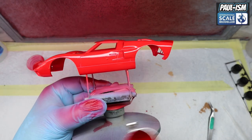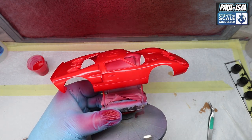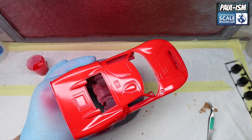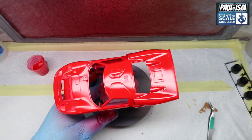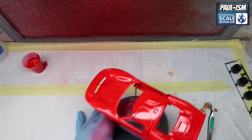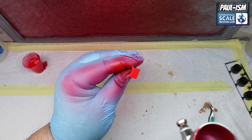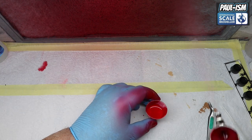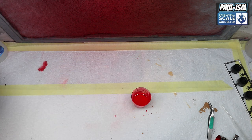Our fourth and final coat — we can put this on a little bit heavier, but not too much; we're never trying to flood it. Really take your time on the final coat to inspect it all and make sure there's no pink primer showing through. We're putting a slightly wetter coat down now and getting a nice gloss finish. This will now be left for 24 hours before we hit it with a barrier coat of LP9 Clear. In total I used about 8ml of paint for the entire body. The remaining thinned paint is put back into the pot, marked as thinned for future use.